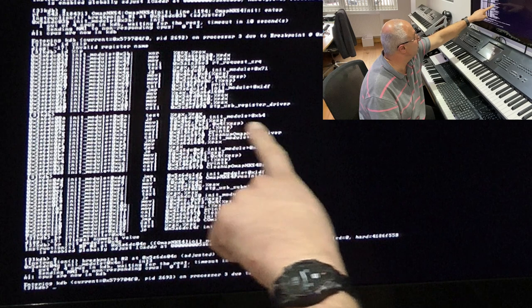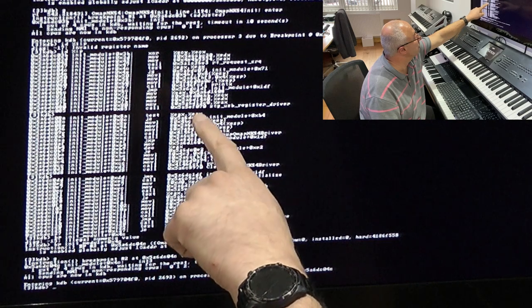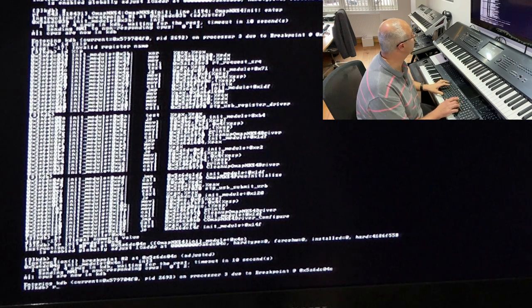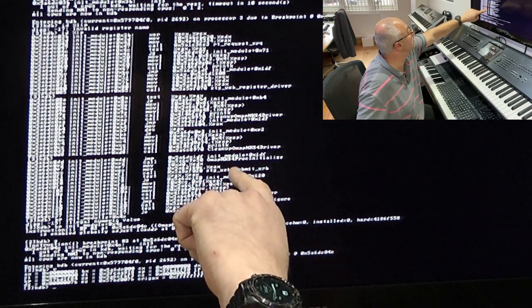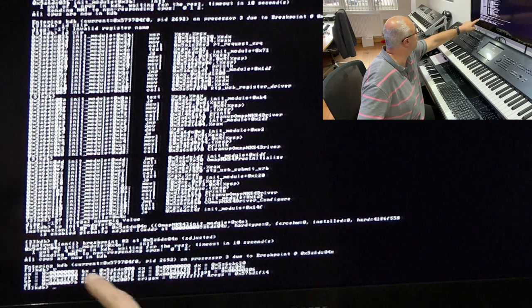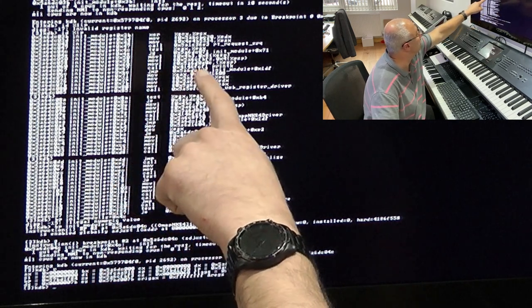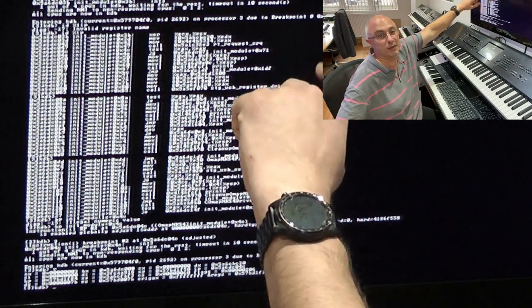So it'll do stuff and then call STG USB register driver. And that means, where has it gone? Let's just trace it. Actually, before I trace it, let's just do an R. So AX is now, what is it called, where is that, breakpoint, hold on module, yeah, so the 4C, which is this one, the call RT request SRQ, I completely forgot, sorry, I'm running half my brain, but don't worry.